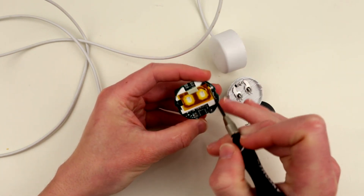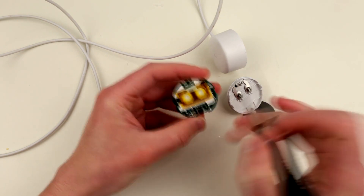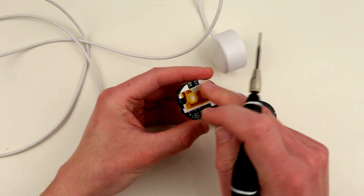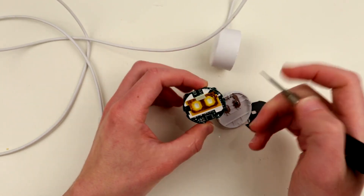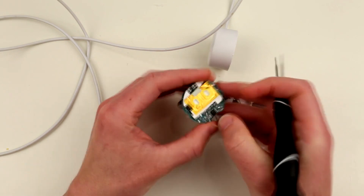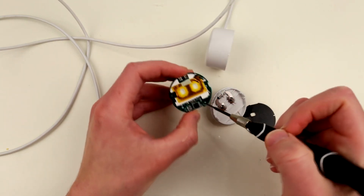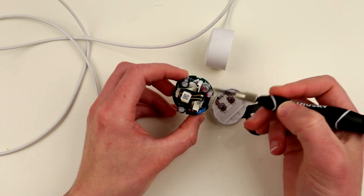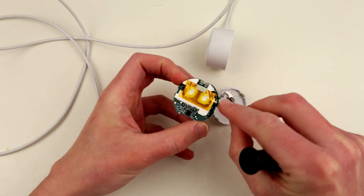What is that? It looks like a coil, but it's probably some kind of shielding. It looks like shielding to protect from electromagnetic radiation, and they've done a good job — it's soldered to what I guess is ground. There's no ground pin on this power supply itself, but look at this insulation — it's plastic that covers everything to prevent mains leakage into the board and subsequently into the wire. It completely insulates the secondary part from the primary.